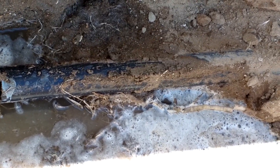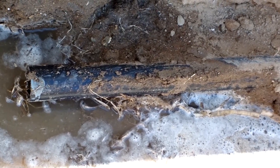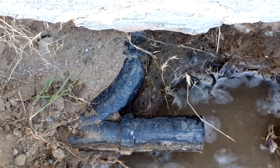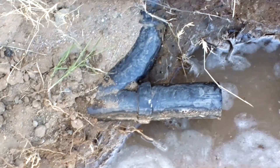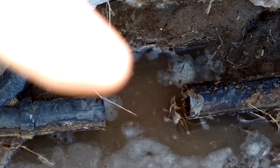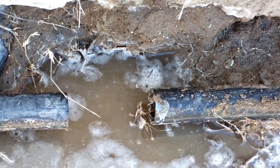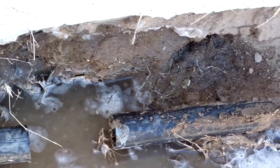Hello, Oddjobdewer here, and we're on the site of the catastrophic plumbing event. As you see here, you've got some black ABS pipe. It comes down here, there's a notch cut out of it. It comes down here and there's a place where more piping joins. This notch was to help relieve the fact that down the pipe this way there was a clog — most heinous. When it clogged, the water came back up through this pipe here which goes down and into the house, into where the washing machine goes.